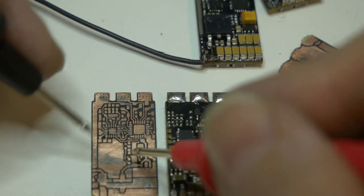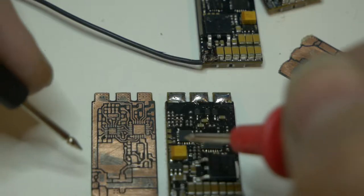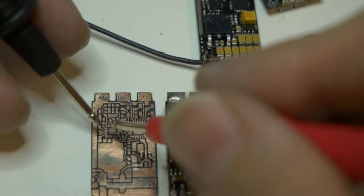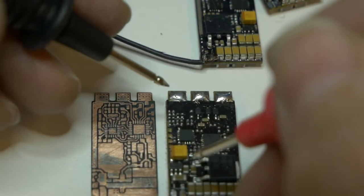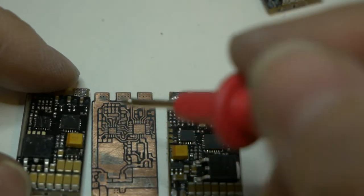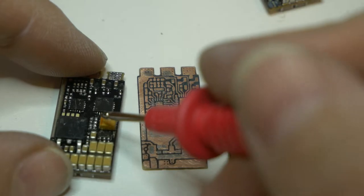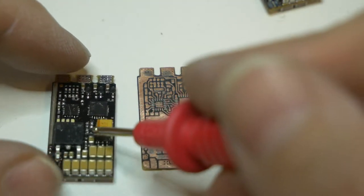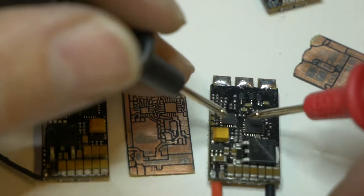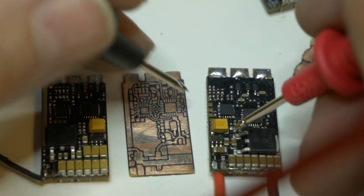maybe I could find, okay, here's the big if. If I could find the resistor that's down here, since I can't find it from the signal path coming up to it first, maybe I can find it from this first pin, left side, whatever, coming back down. So I look, and I see a row of resistors right here. Well, there's some stuff not populated here, but this is the resistor I'm after right there, if you can see that. Over in this one here, there's a row of resistors right there. My first best guess is maybe the obvious one, that it's this one down here at the bottom.